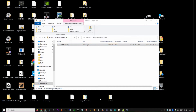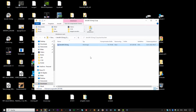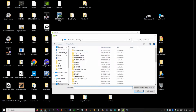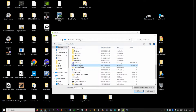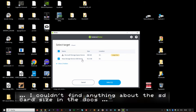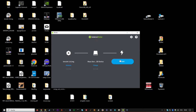Unpack the image wherever you like. Then open Balena Etcher - I'll put a link in the description. Click 'Flash from file', make sure your SD card is inserted, find the BMC64 image on your desktop, select the target SD card - I think it needs to be at least 8 gigs - then click 'Flash' and wait a moment.